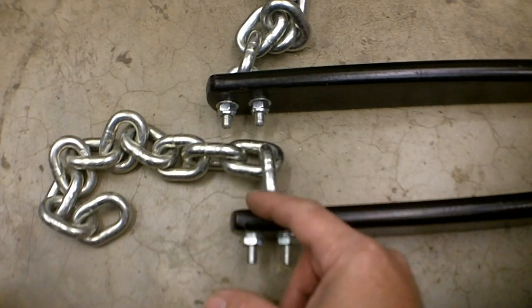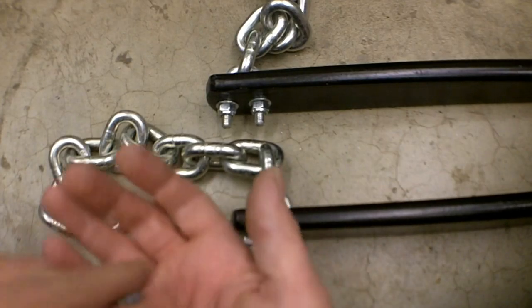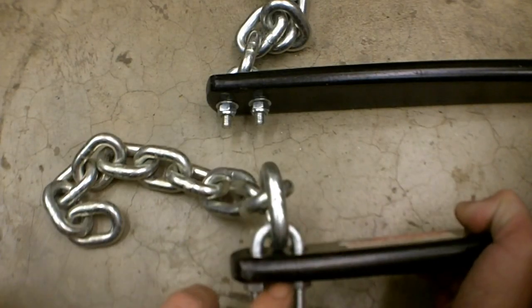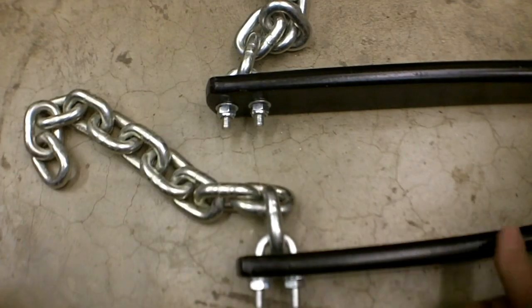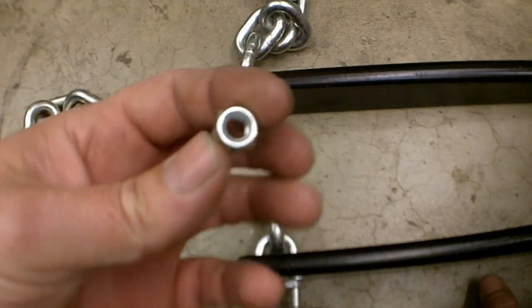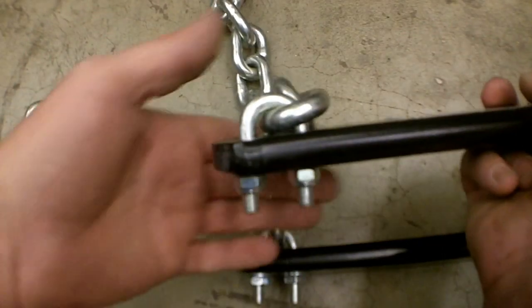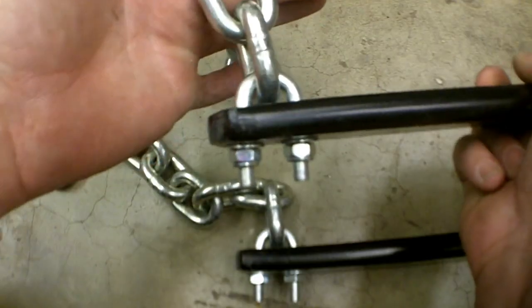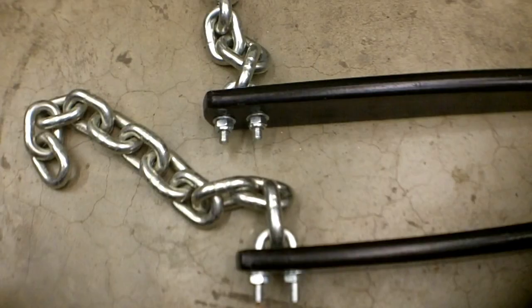I'm rearranging the steps in the manual to suit my taste — I think they did some things in an odd manner. In this particular step, I'm installing the U-bolts and locking them down. They do come with two washers and two regular nuts. I'm ditching the regular nuts because when you have this tightened up all the way, this link here is in a bind. It probably doesn't matter, but I don't like it, so I'm changing it. I picked up four M8 by 1.25 pitch nyloc nuts. Here's one that I've completed — the nylocs are on here now with the washers beneath it, and the chain is free to do whatever it wants to do.